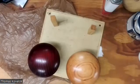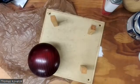John, do you steel wool in between coats at all? I do, Jim. Yeah, sometimes. Not every time, but sometimes the end grain will raise, even though it's not water. And I do sand. When I sand these things, I sand both directions. That's important. I should have brought that up before. I sand pretty much everything I make in both directions on the lathe, just for that reason, to get the grain that might lay down. It's very important to get it once you get up to 400, 600, that very fine grain. But this thing feels like a baby's butt. I mean, it's really smooth, and that's important. You don't want to be all funky.